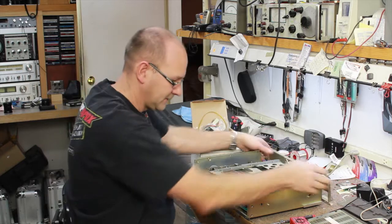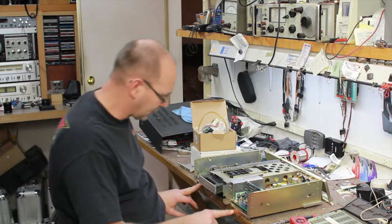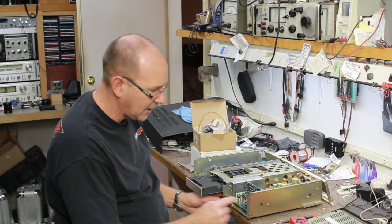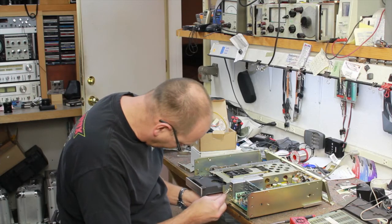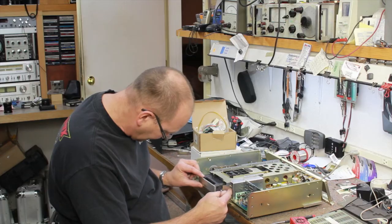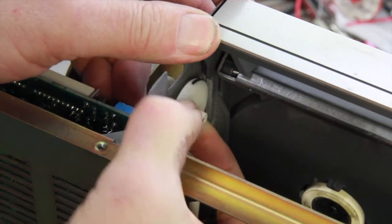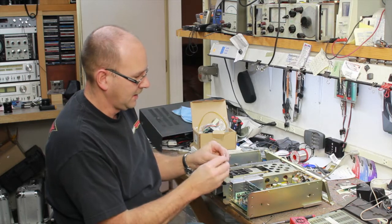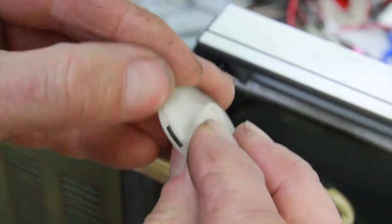Then I pull off this metal part here. There's two screws here, like four across the bottom. Then to get that pulley off, there's a little snap ring you have to take off right here. Then you take a little box-end or open-end wrench, loosen up the nuts on the top right here. Then you lift up — that gives it some play — and pull out this pulley right here. It has the O-ring on it.